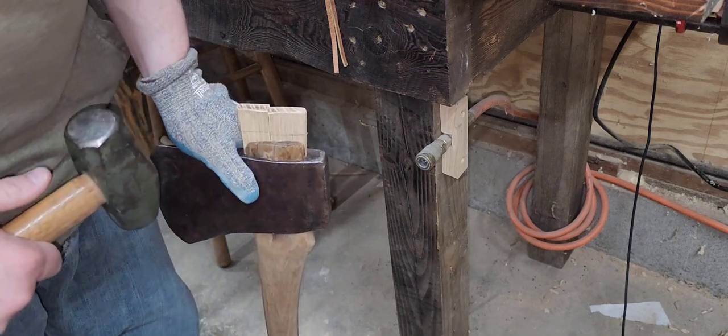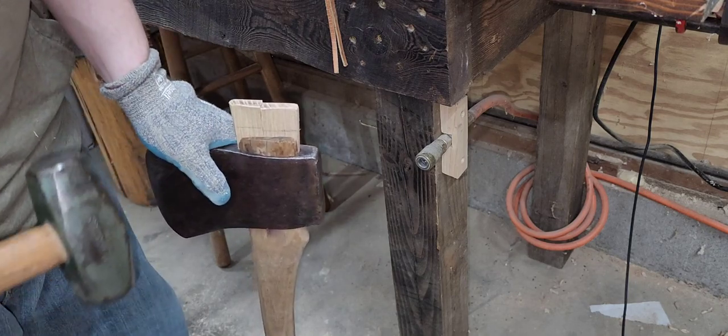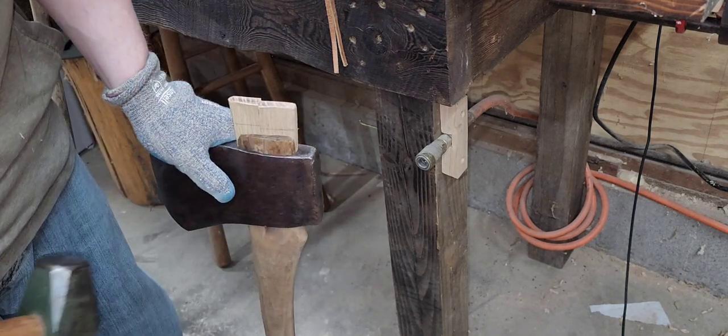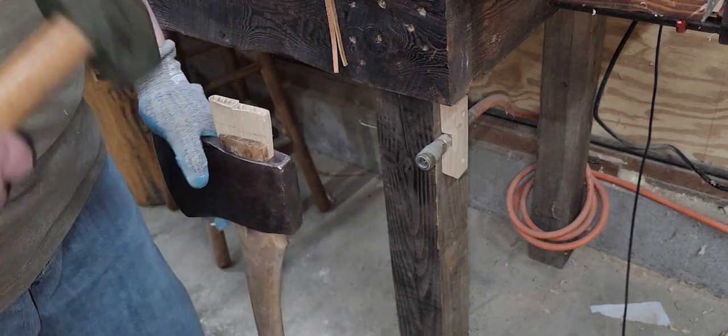I'm perfectly okay with that wedge splitting. If half of it drives further down in, okay. If the front half does, that's okay too. It means I'm getting better compression because it split. Well, not because it split, but the splitting allows it to get proper compression. You can get good compression without it splitting too.